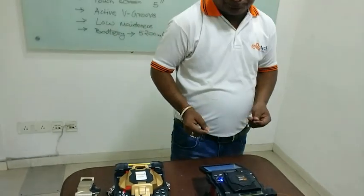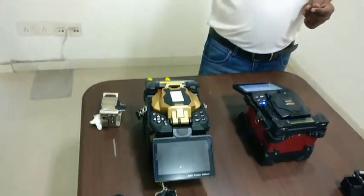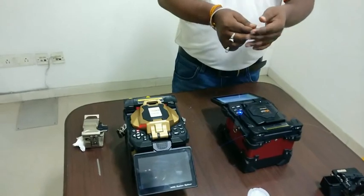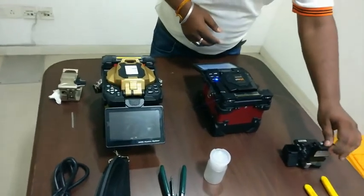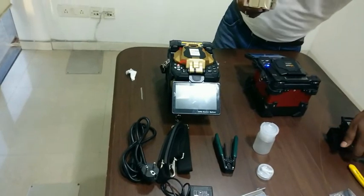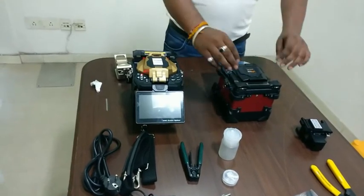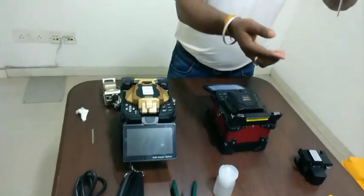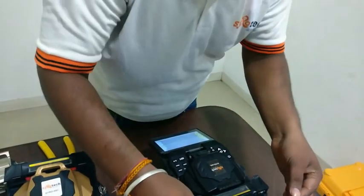I will show you something else — isopropyl alcohol. We use alcohol for fiber cleaning. When we clean the fiber, we use alcohol. There are two types of cleaver; I will show both. Heating is complete. I open the heater; the light indicator is off. This is the cooling tray — I place the splice here because it is still warm.